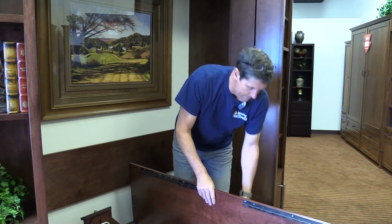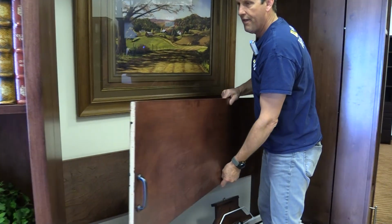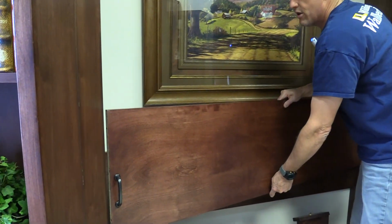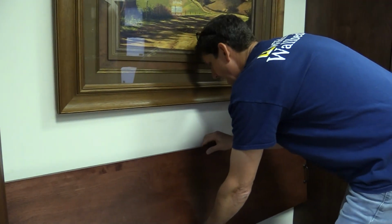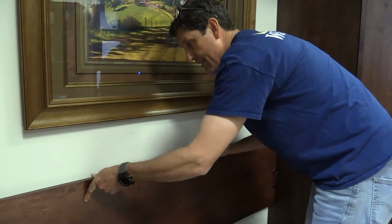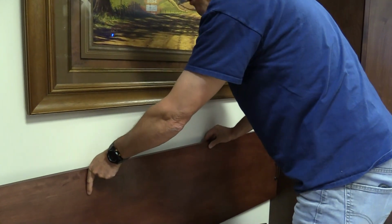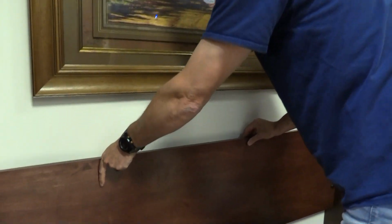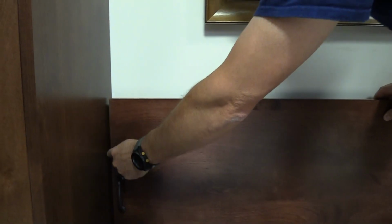Now I'm going to take that headboard and slip it between these sideboards, and it'll be somewhat close. And then because I have those hinges out at about a 90 degree angle, and I'm keeping my hand against this because it will slip off, I'm going to keep this pushed back, and I'm going to center this new headboard between these two sideboards. It leaves about 1/4 of an inch over on this side so that this headboard can hinge.